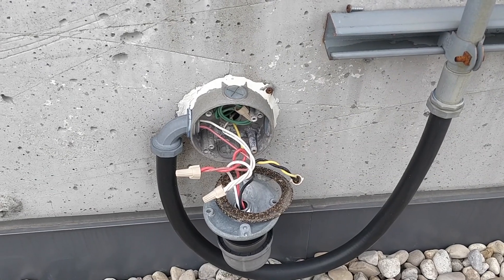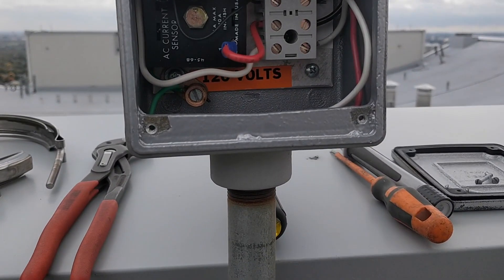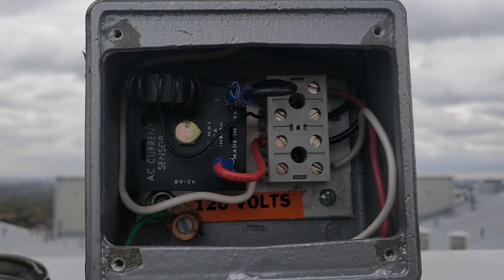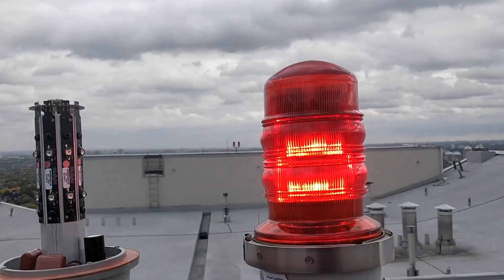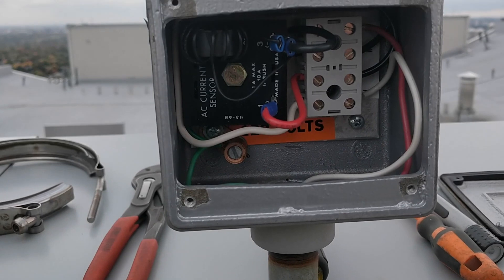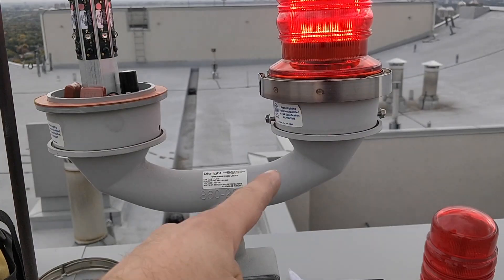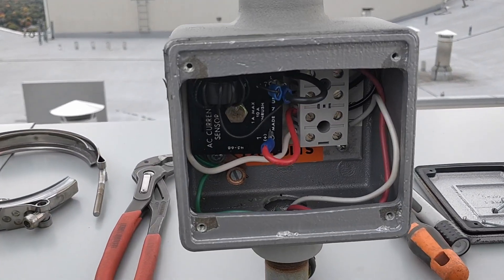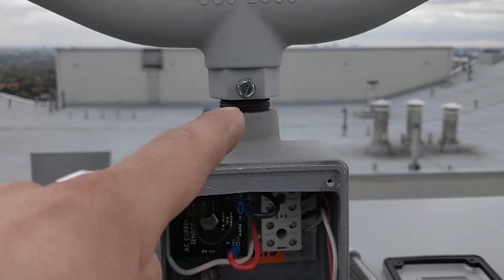It's quite simple the way they work — there's only line and neutral coming in, goes through the photo cell, sends the signal to this little junction box. What you've got here is a relay which is sensing one of the lights, that one. So when this light goes out, that relay will trip, it'll open, and it'll start the other light. As long as you've got power coming in through here going through the light, it goes through the relay, and when this light is out there's no more AC current — the sensor isn't sensing anything anymore.